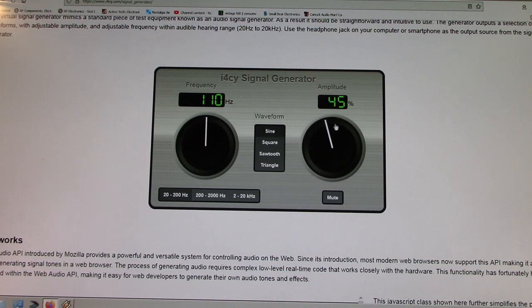Cranking up the volume on the amp — and already I can hear an offensive noise. What you heard there is the left speaker. The right speaker is working normally and producing a pure tone, but it's quieter than the left side because the left side is buzzing, creating harmonics and distortion — and those noises are overpowering the program material. Let's look deeper. I'll switch the balance over to the right speaker first.